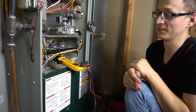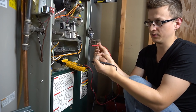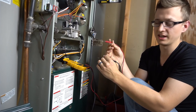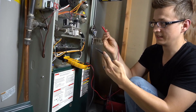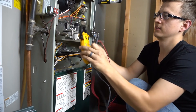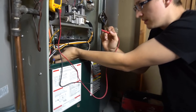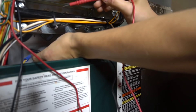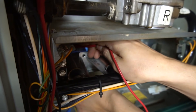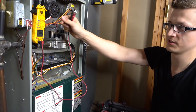If you have the igniter glowing but no voltage at the flame sensor, then you know the problem is actually the control board, or maybe a broken wire, and not the flame sensor itself. And here's a cool thing: since the ions in the flame create a high-resistant path for electrons, there's literally voltage in the flame. If you stick one lead into the base of the flame and the other on the flame sensor, you should have some voltage present. I tried it and I have 8 volts present in the flame — so you can actually read voltage inside the flame.